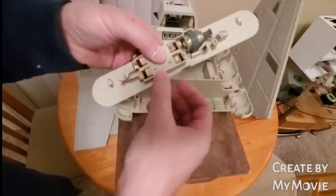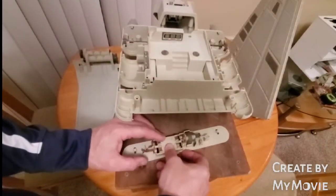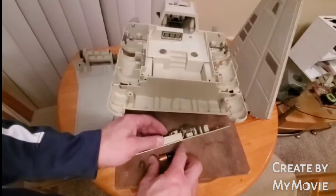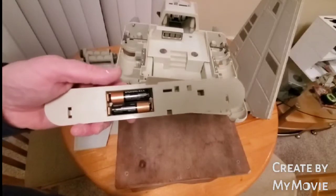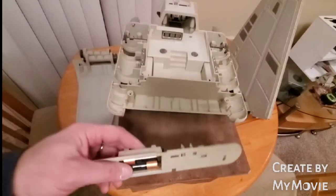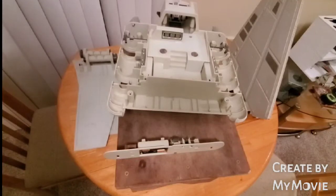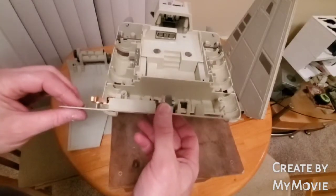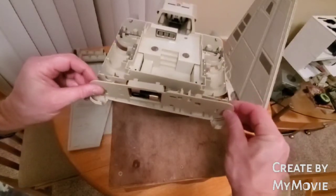If it doesn't turn, hold the contacts in and keep the batteries on a flat surface so they won't pop out, then manually move the armature around and eventually you'll get it to move. Another trick: when three volts haven't worked, I've jump-started the motor using a nine-volt battery. I have pretty much all the ships with motors, and 100% of the stuck motors I've gotten to work — they're very durable. Don't give up.